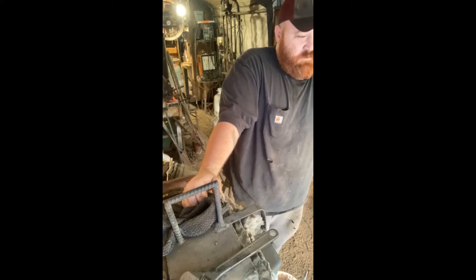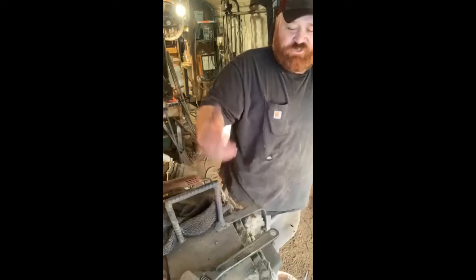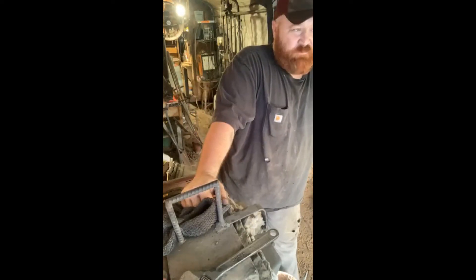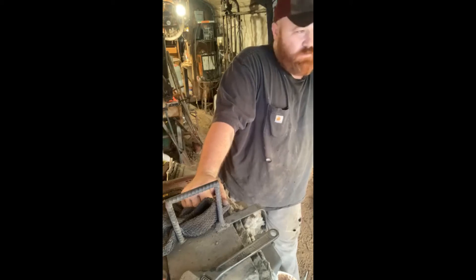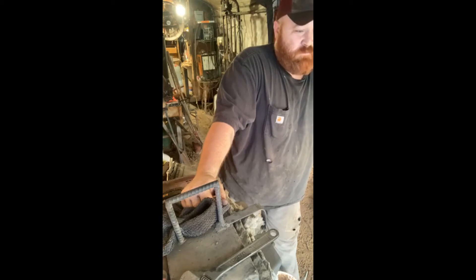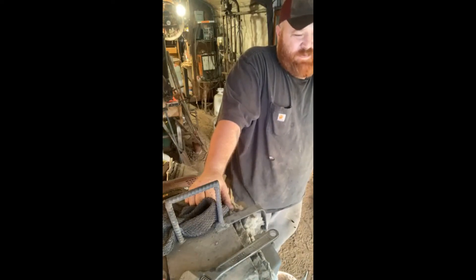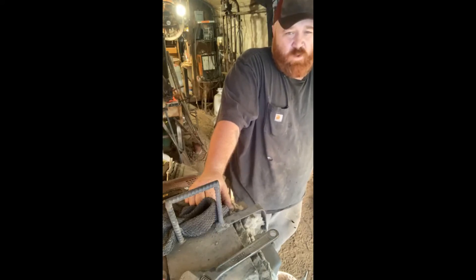When you're buying a knife or a tool, think about why you're buying it. Today we're doing what's called a faggot weld — when you stack up strips of steel and forge them together to make a billet or a bar, bundling steel to make a bigger, thicker product. What we're really doing is adding a flux material, basically an antioxidant, because oxygen is the antithesis to any kind of weld.